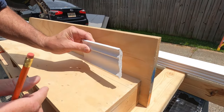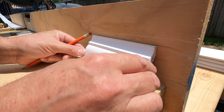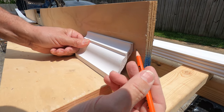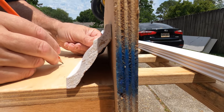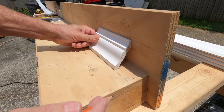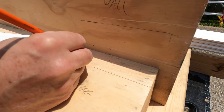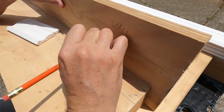We cut a piece of our crown and it's upside down. We rotated it until this edge was flush here. This represents the wall and the table actually represents the ceiling. We determined that it goes right there and we made a mark there and there. It turns out that this dimension is two inches and this one's two and five eighths.